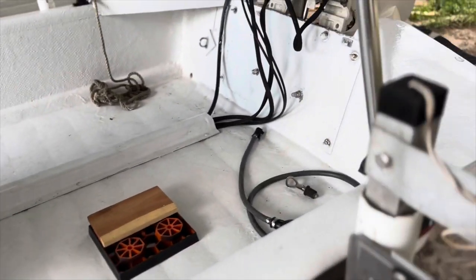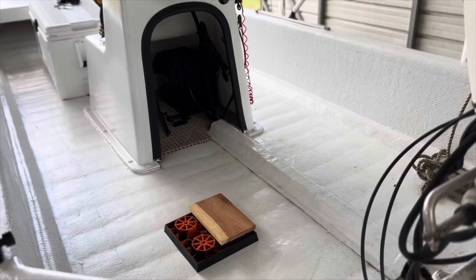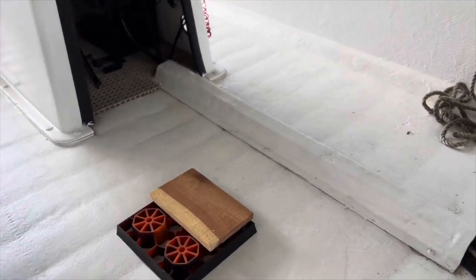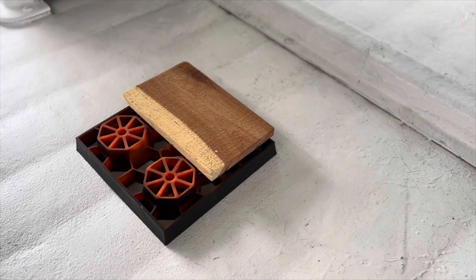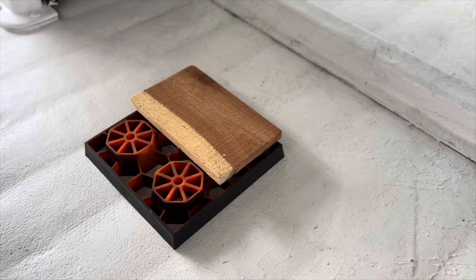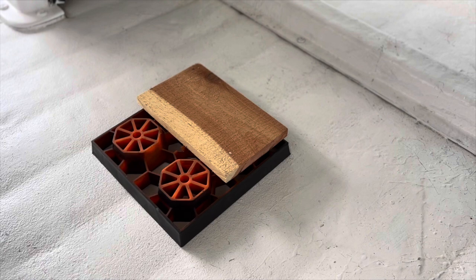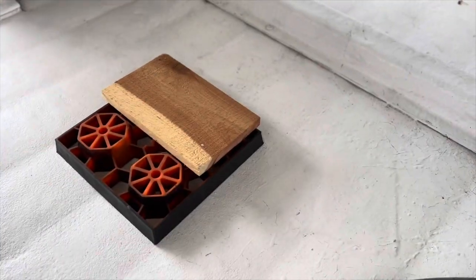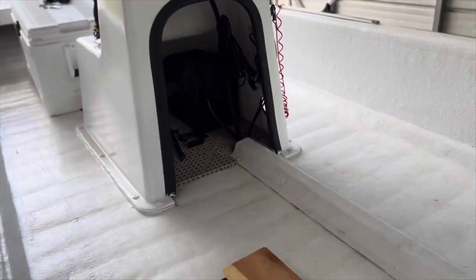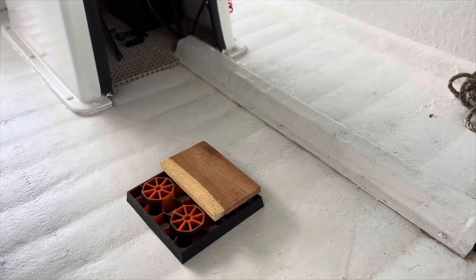The first thing I had to do was deal with the chase for the controls, which runs on the floor on these Carolina skiffs. They're pretty basic boats — they don't come with a whole lot of bells and whistles, and that's how the controls were run through. So I had to think of something as a spacer. It's not pretty, but you're never going to see it because it's going to be under the cooler. Now we just have to set the cooler on top, figure out how it's going to sit, and put the screws into the floor.